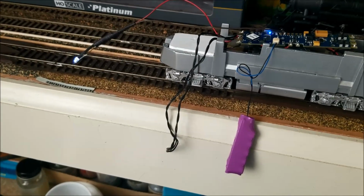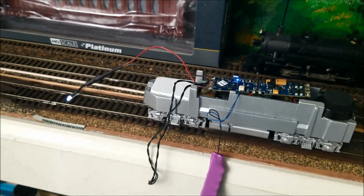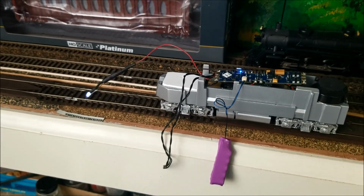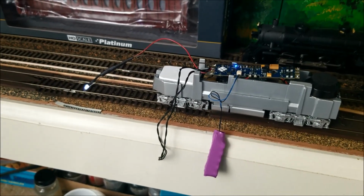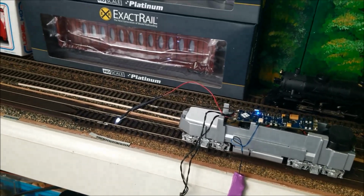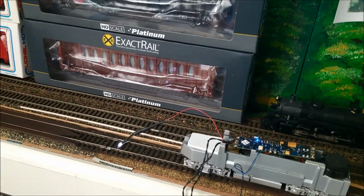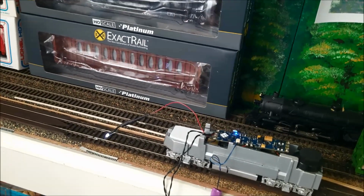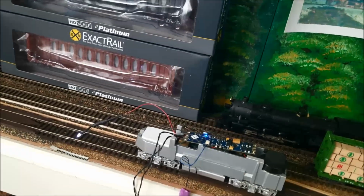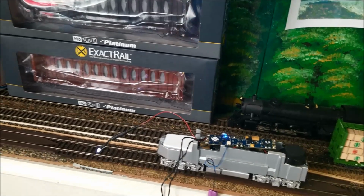There's our 1.5 light bulbs. Hooked those up wrong. I should have known better. We had a 1.5 spot on the board to hook those to, and we didn't do it. Blew those, but that's okay because we were going to change that to an LED anyway. So anyway, that's where the project goes. So we're waiting on parts. We've ordered some tower LEDs, 2mm, 2 and 3mm, and we got some 750 ohm resistors coming as per somebody's instructions. Right, George? Okay. All right.